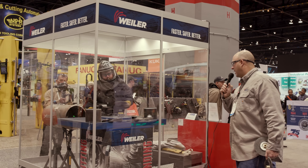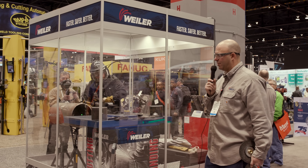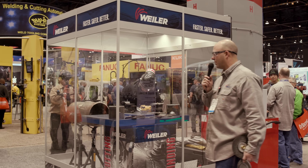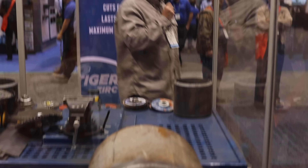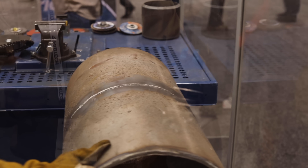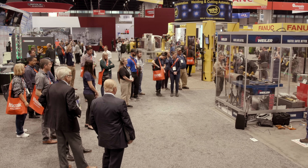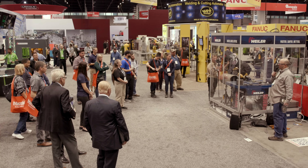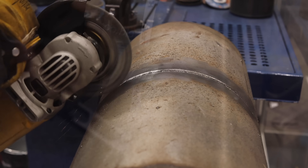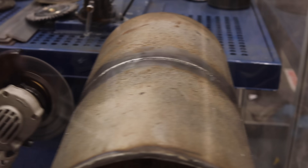The next one he's going to put on is the Dually. You can see him putting it on almost in reverse — he can put that on reverse or standard as he flips that wheel. The Dually is going to allow him to flip it back and forth, remove the memory we talked about, and give that self-sharpening action. You don't want to put a lot of pressure with a wire brush — let the tips do the work. As he spins it around, you can see what we call an orange peel finish instead of a scratch brush finish, and there's no scratch pattern. As he goes through, you can see how easily he removes any type of inclusions in the weld.